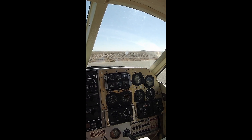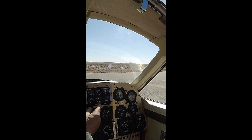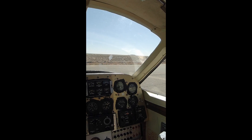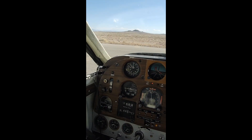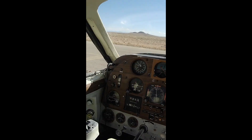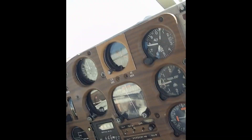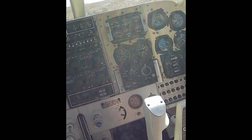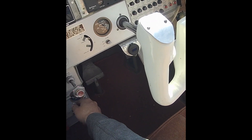The starter is giving me trouble. And when I do that — look what it does to the oil temperature. Something's not right there. Let's let her cool down, because that's what I did last time and it worked. Another problem I have is down here — if I turn on the battery you'll see it immediately: the fuel quantity on this one shows, but not on this one. So we're going to need to check that.